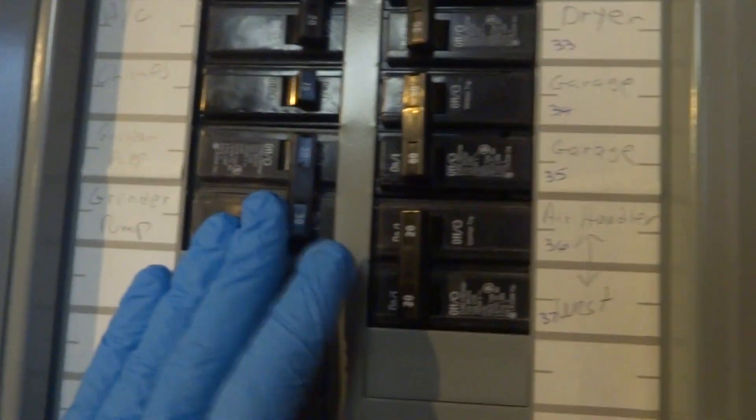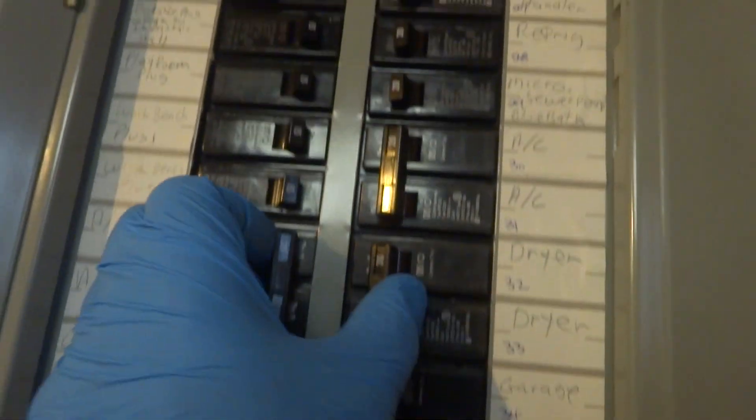The filter's brand new — good. Checked the piston; this one's fine too. So we're going to check the units outside. Make sure they're on — I did check them, everything's on. We'll go check the units outside, make sure they're clean, then we'll run them. We'll see what our wet bulb is in here.